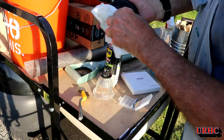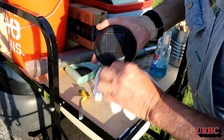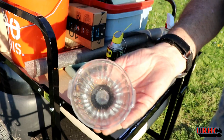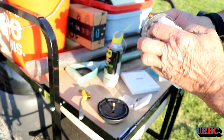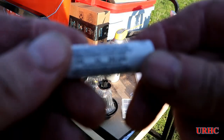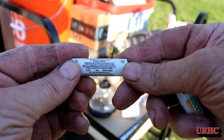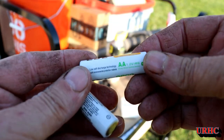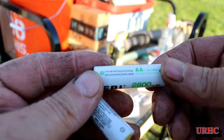These lights actually have a glass solar panel on the top too, which makes them really easy to clean up. Some of the ones with plastic panels can be a problem. I'd recommend that if you buy lights, buy a slightly better quality one that you can always just put new batteries in later. You can see the old one here is a NiCAD 300 milliamp, and the new one is a nickel metal hydride 2800 milliamps — a big difference in capacity.